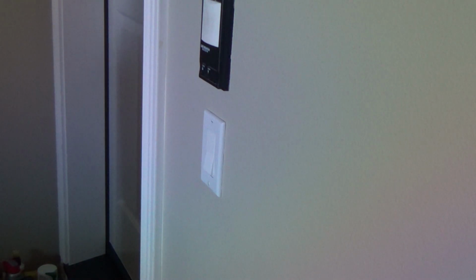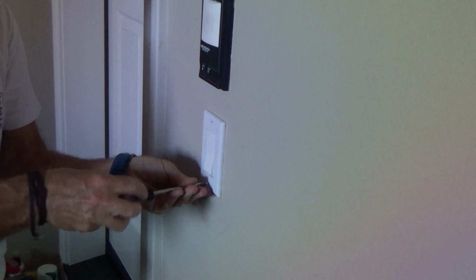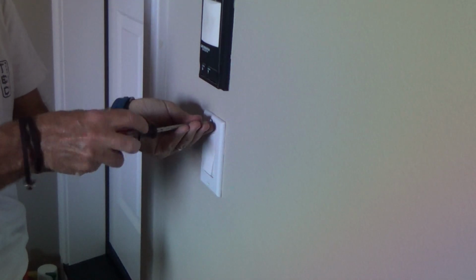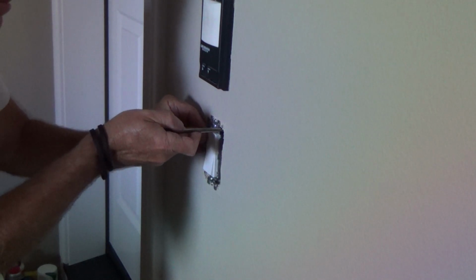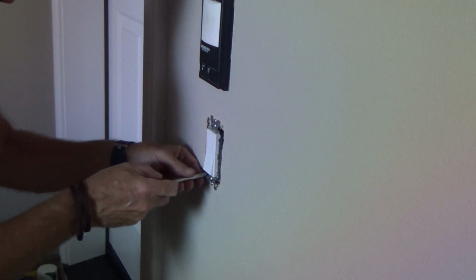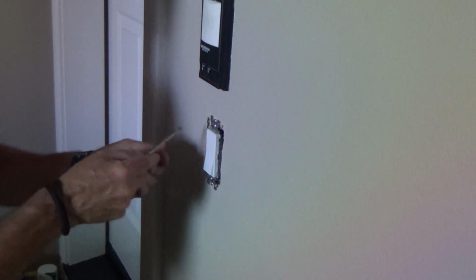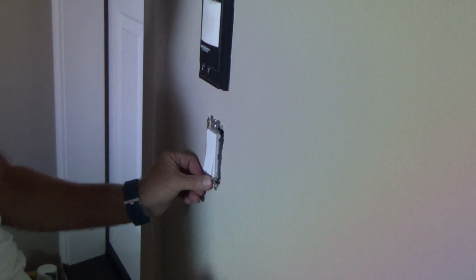10 1/16 to the right, 10 and almost a 16th to that right. It still slightly looks crooked. Not very much. Maybe the door jamb trim is slightly off. I think I can do a little better. The top needs to go over to the left, just a little bit, just probably about like that. And see, if you have it just right, you could do it with that, or you may have to undo the screw a little bit.